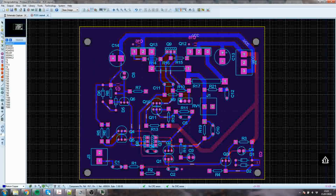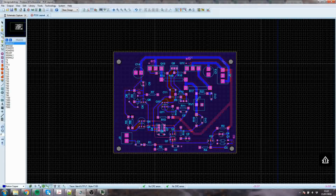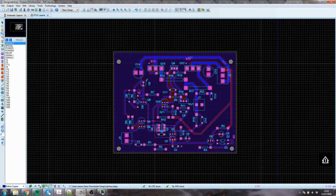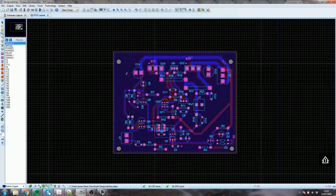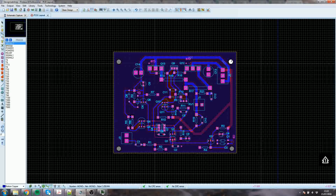And that's broadly it. I'd produce this now with those changes that I just suggested. You're going to put your name on it, I guess. That's more or less it. Minor detail, depends how you're going to mount your heatsink, but if your heatsink extends the full width of this board, then you won't be able to put a nut onto whatever thread you have here, which holds the board to the enclosure, because the heatsink will be on top of it, so you might want to move those to a slightly different position.